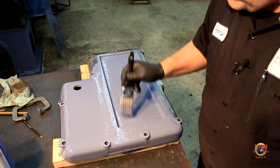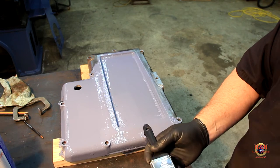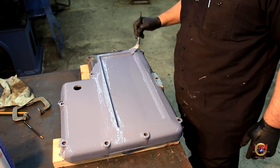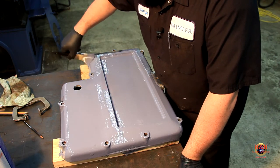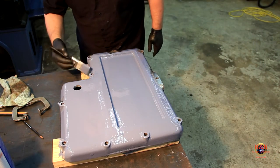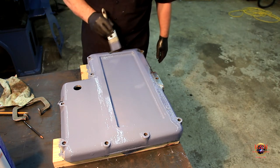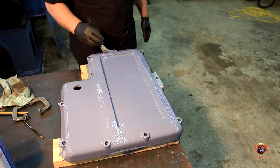We're going to get this on here. What else? I reckon I got to put in there. I can rebuild all the dials and stuff like that. Of course, I need to source out or get made or make everything, because the lathe has metric dials on it, so I need to change those out to inch ones. And then I need to measure the cross slide screw and see what it actually is. It had the 100, so I'm assuming that it's stamped 100 millimeters, so I'm assuming that it did the radius travel and not the whole diameter. I want to do the whole diameter.